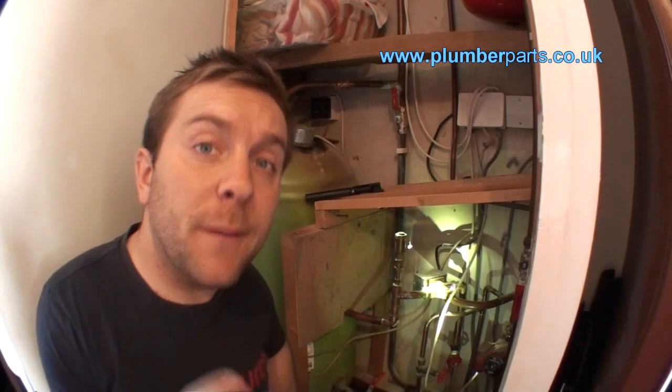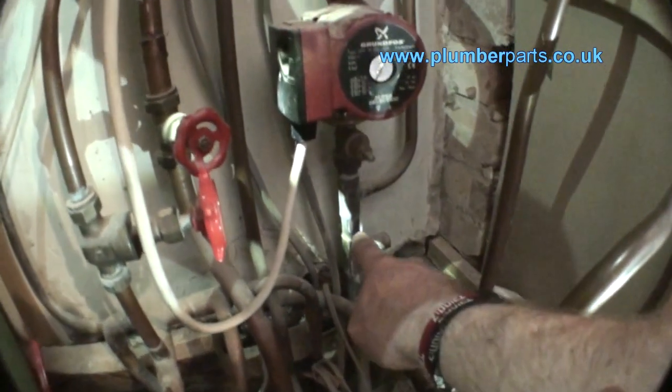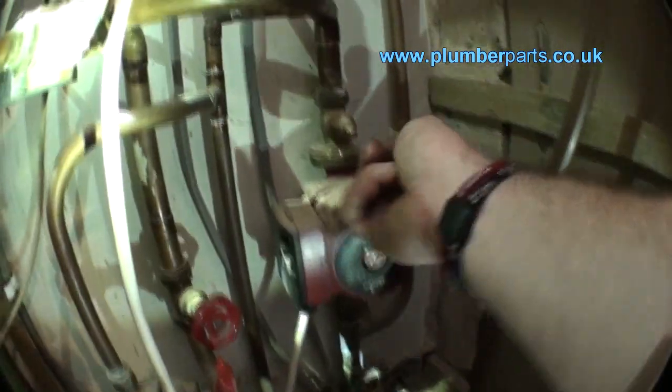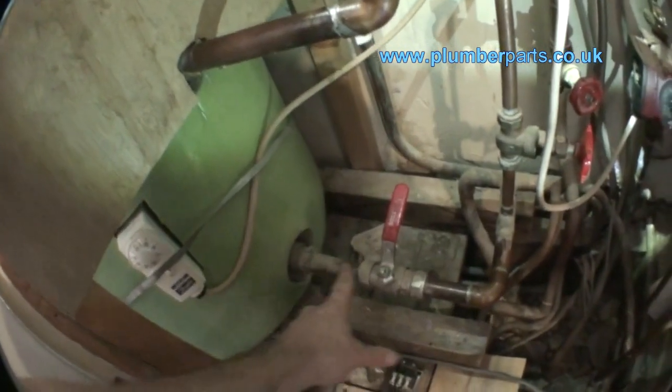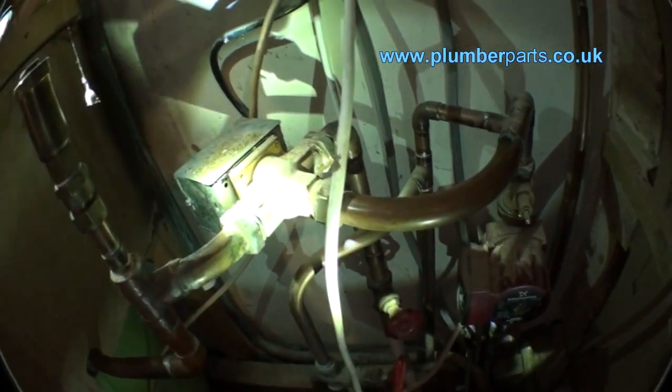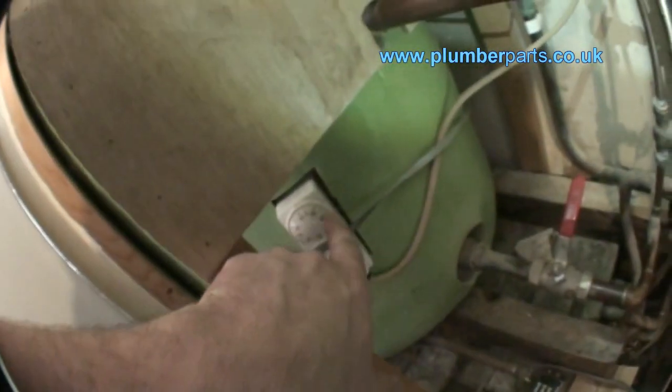Let's firstly have a look at the position of the three-port valve in the heating system. This pipe here is the flow from our boiler. It comes up here, through the pump, it's pumped up through this pipe here to our three-port valve. What the three-port valve then does is divert hot water either through here into the coil of the hot water tank and back out to the boiler, or through here, which is off down to the heating system, to the radiators. It does that according to whether it's being controlled by either the thermostat on the side of the tank, for this side, or your thermostat in your room, which will send it off down this side.